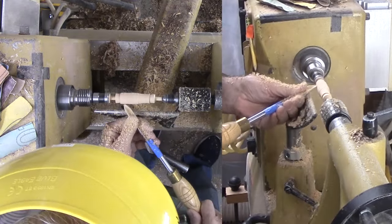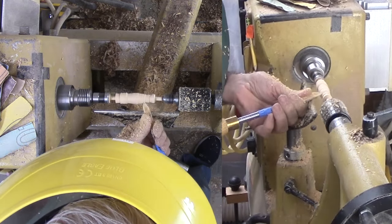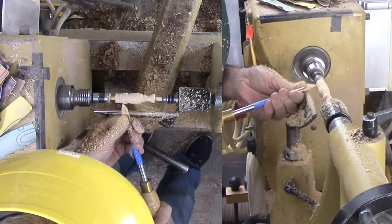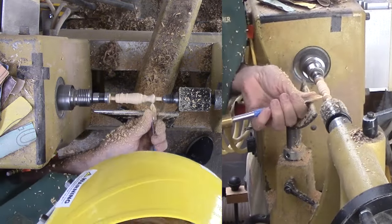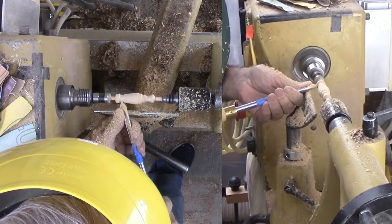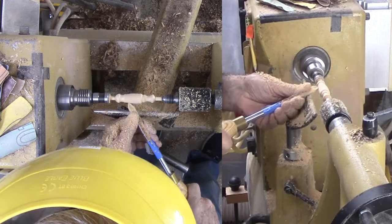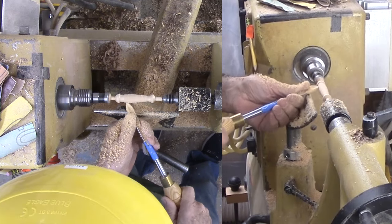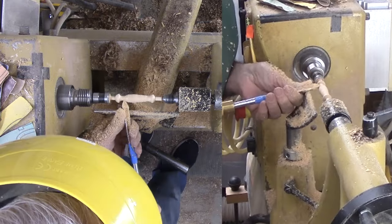Then continue to shape the stem. At first I thought to leave a bead at the center, but since it was not quite centered and could be a distraction anyway, I cut it off and went for a more simple design, which is perfect for this goblet. I did have one problem here — the wood holding the drive center teeth splintered off, letting the wood spin easily. I could not clamp the tailstock more for fear of splitting the tenon on that end. So I had to be careful and take very small bites with the spindle gouge and ultimately the skew.